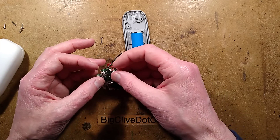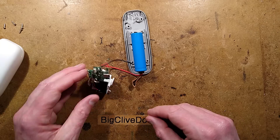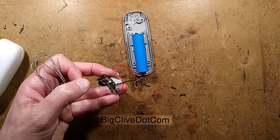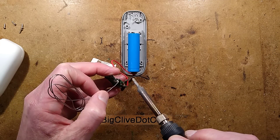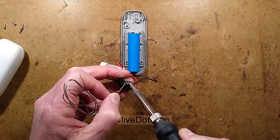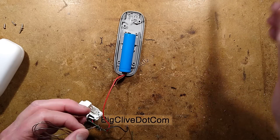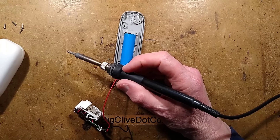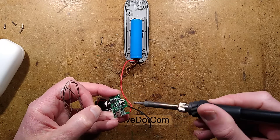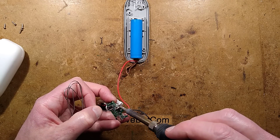I'll get the soldering iron and take that switch off — I'm suspicious it's faulty. If we remove the switch and the fault clears and it doesn't power up, that will confirm it. I have a sneaky suspicion this might be tin whiskers. Tin whiskers are a molecular-level growth of tiny whiskers of tin, and they're a bit of a curse to the electronics industry, introduced when eco warriors banned lead from solder. Lead was actually in solder for a reason — to make it malleable and avoid problems like this.